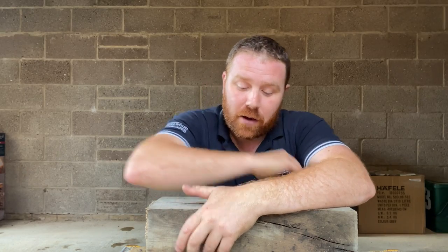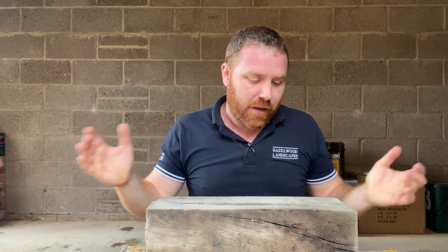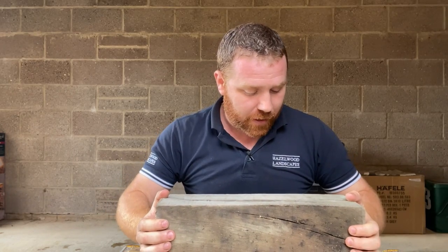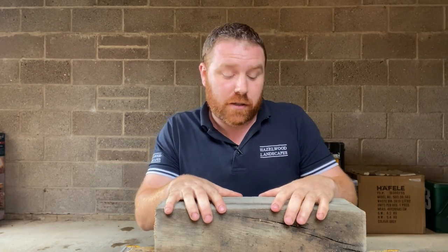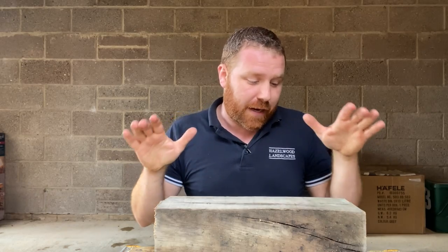When it comes to the wood itself, all you need is three pieces of wood. Bamboo canes work and you can put a little frame around them, but I think something like this has a very natural finish. I've got a piece of five-inch by five-inch oak — 12.5 by 12.5 centimetres — and this is untreated. It's best, if you can, to use untreated timbers, because bees are highly sensitive creatures and will want something as natural as possible. The same applies to bat boxes and bird boxes.